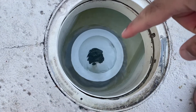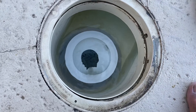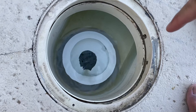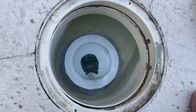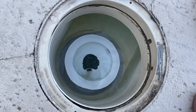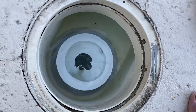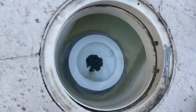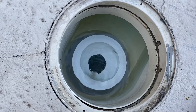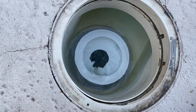One of the problems is when the water line falls kind of low, the Bernoulli effect happens even stronger and actually hollows out the center of the unit, and it shuts down the pump because the pump starts sucking air. I noticed my pump was shutting on and off dozens of times in a row. I came out and found that's what was happening and had to put more water in the pool. With my regular basket I don't really have to worry about that — it's always got enough water. But this can actually suck down more water and create a little vacuum, which is not what you want.